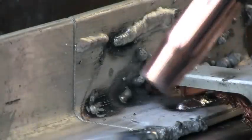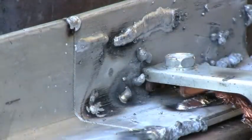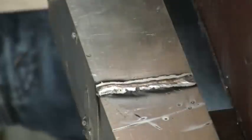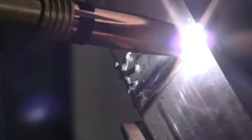Here's me just doing some tacking on this aluminum angle iron as the welds get better. I think this is a good spool gun. I've never used a spool gun before, but it's working. It's a lot easier than I thought it would be after I got it figured out. Here's me going uphill and I kind of melt through. I wasn't even on full power, so that's good that it can be strong enough to melt through. Once I learn my technique, that'll probably be a good thing.